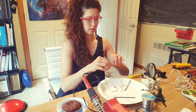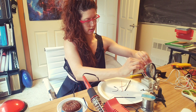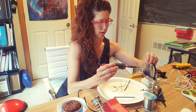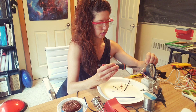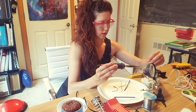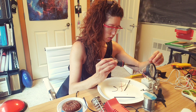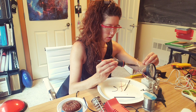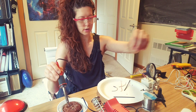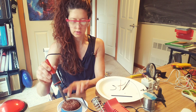I just cut a couple of male jumper wires. I align them so that the wires are parallel, and then I twist them together. Then we bring back the soldering iron — we're going to heat the joint and apply some solder to it to make a nice solid electrical connection. The twisting acts as both a mechanical and an electrical connection, but the solder really solidifies that. Note that solder is not a mechanical connection, so be very gentle when you're pulling on any solder joints. Solder is not super strong — it's better than nothing, but it's not super strong. I like to keep my tip nice and shiny.